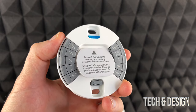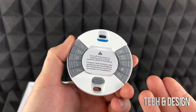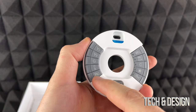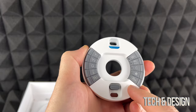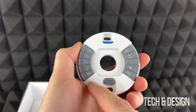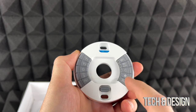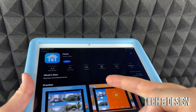You have to turn off the power before we keep going. Now, some of you may just have a wire labeled R - not RH or RC - just attach that R wire to RH and that should work just fine. RH is for heating and RC is for cooling, but a lot of people just have the single R wire, and it can go to either, though most prefer to hook it up to RH.